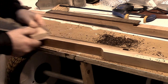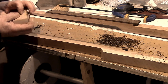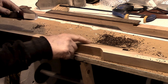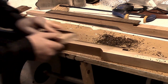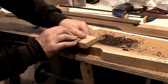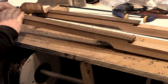Then I can just finish that off with my block and 120-grit sandpaper. You can just see a little mark here — just move to get a fresher piece of sandpaper. Sometimes I'll turn it round to use the sandpaper a bit more efficiently. I can see there's a little bit of a shadow where the dust is still building up — I think it's gone now. There we go, I think we're about right. And again I just break the edge — just to get rid of that very sharp edge.